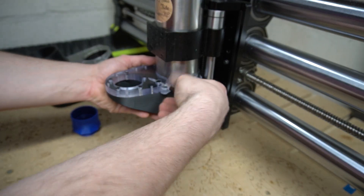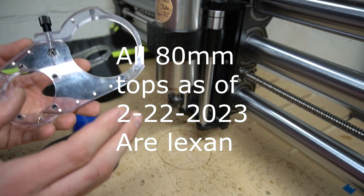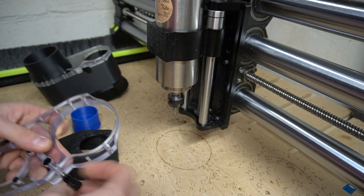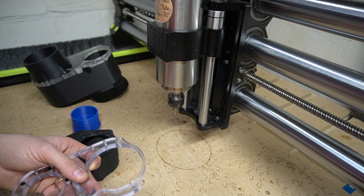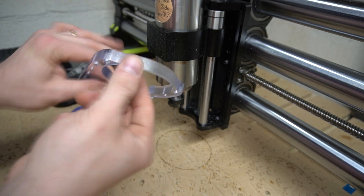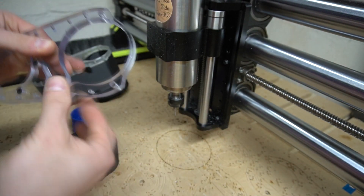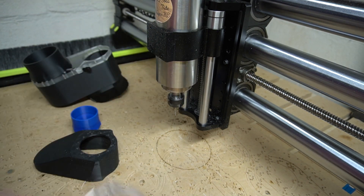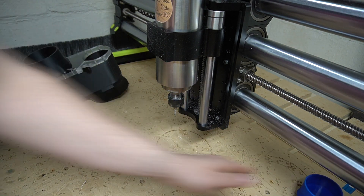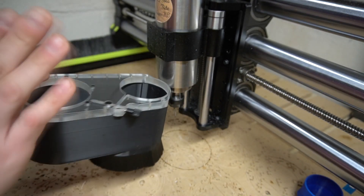All these tops on all the 80 millimeters are made out of Lexan. The nice thing about Lexan is it does not just shatter. If I was to take this dust boot — which I'm not going to do — I could bend it all the way around on itself and it would just bend. You'd have to try to force it back obviously, but the point is you're not going to get it to shatter. That is really cool about Lexan, and all the 80 millimeter boots are made out of Lexan.